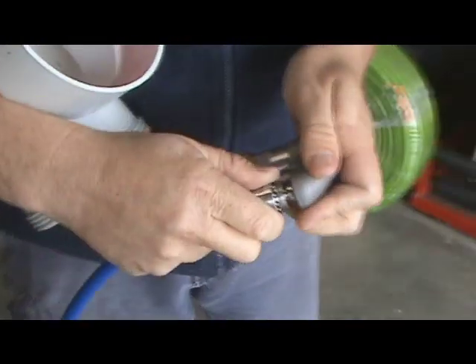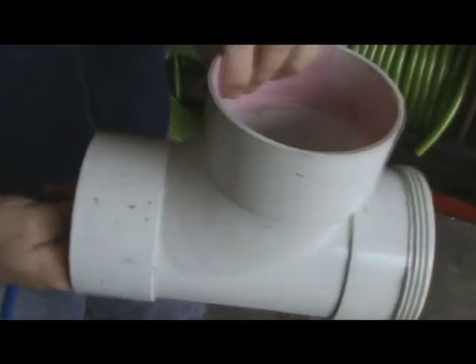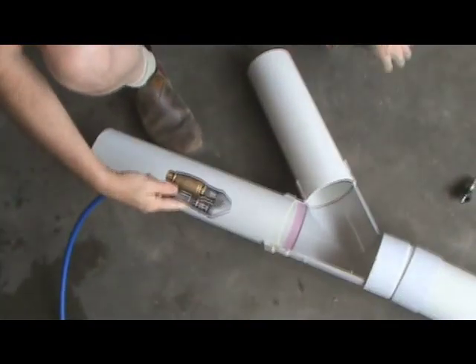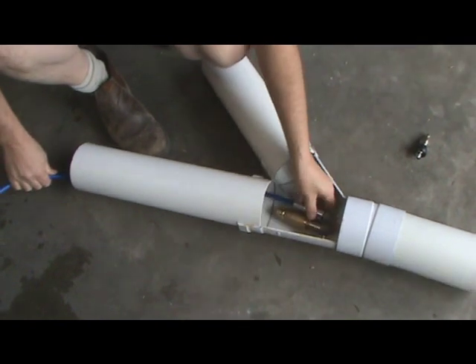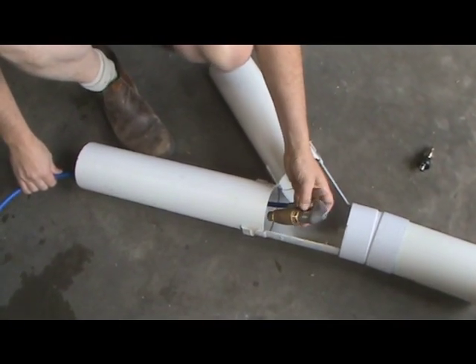Here's an extension - one I prepared earlier. When it goes around, it won't want to go up there because it's too long - it'll go straight past it. It also helps in situations like this. If you're going up in the drain, it finds it very difficult to turn around in the pipe because it's just too big. So that extension stops you getting caught up at junctions.